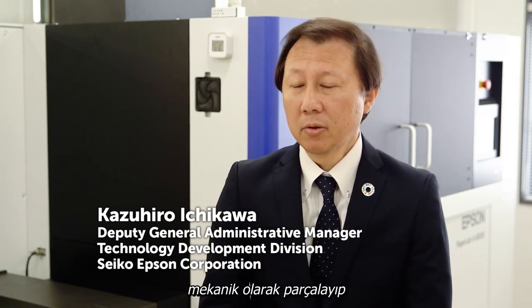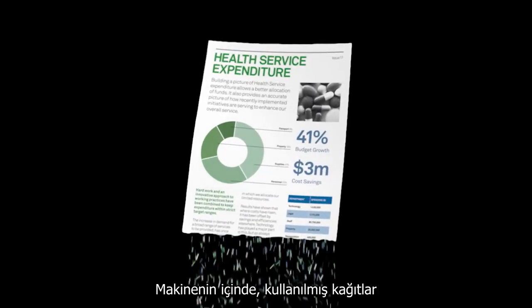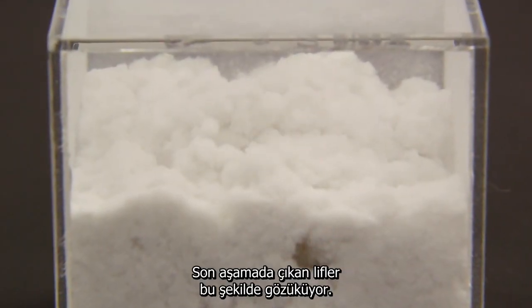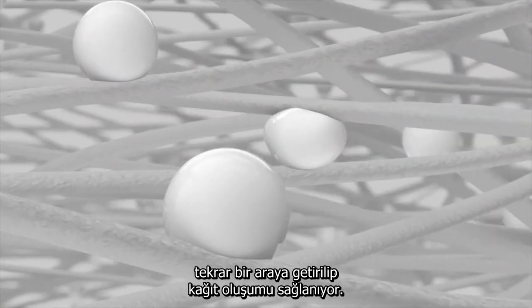The key technology developed was a means for mechanically crushing old paper and reducing it to fibers. In the machine, the used paper is mechanically broken up into small pieces. This process completely obliterates anything printed on the paper. The resulting fiber is then combined with a special binding compound, and the fibers are pressed into sheet paper. Finally, the paper is cut into the desired format.